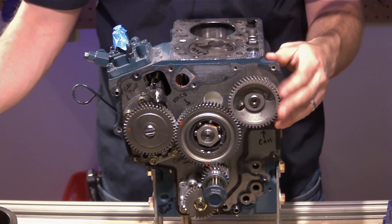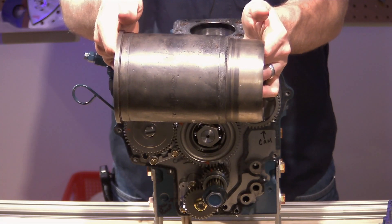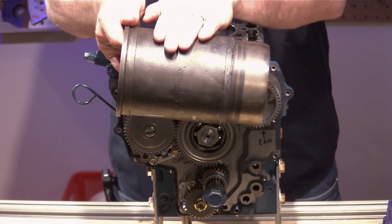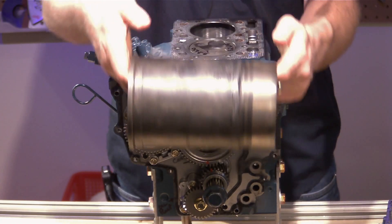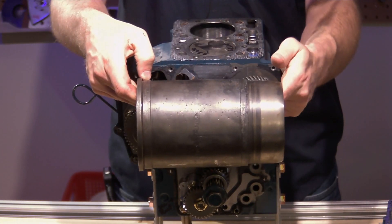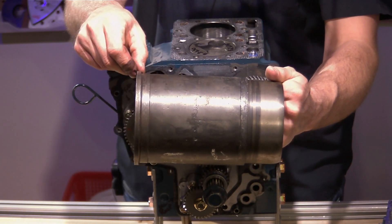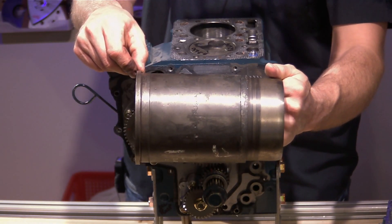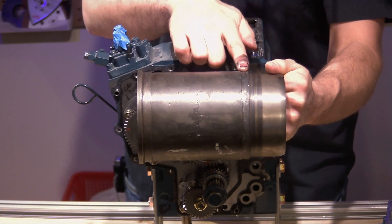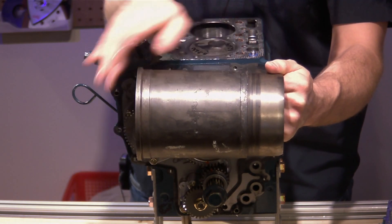Other than a dry fit liner, a more common one in our industry for larger engines would be to use a wet liner. A wet liner has coolant that makes direct contact, circulated by the water pump, and it makes direct contact with the wall of the liner itself, which helps with cooling. To achieve that, we have a seal up on the top just below the flange, cut into a counter bore in the cylinder block, and a rubber seal that sits here and also on this lower land. Those rubber band seals keep the coolant where it's supposed to be.